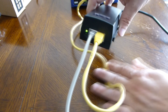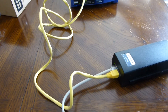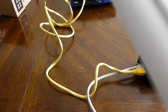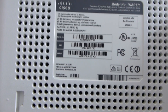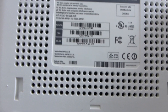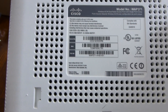Let's plug in the access point first. This is a Cisco WAP371, which supports AC, meaning I can use both 2.4 GHz and 5 GHz frequencies and antennas at the same time — but only if I use a 30 watt PoE injector. If I don't use 30 watts, it only powers one of the antennas. That's the reason for requiring a 30 watt PoE injector.